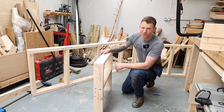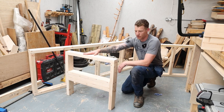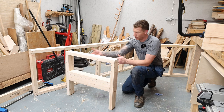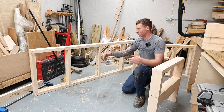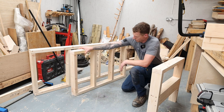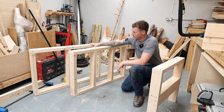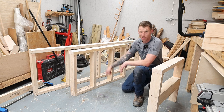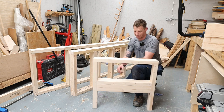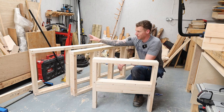All three leg and armrest frames are fully assembled and sanded to 120 grit. Sand before assembly — it's much easier that way. I've also gone ahead and made the seat frames: the long one is 2200mm and the short one is 1100mm. The width of the seat frames uses the exact same cross-piece length as the leg frames, so when you batch those out, set your stop block once and cut enough pieces for all three legs and all the cross pieces for both the long and short seats.